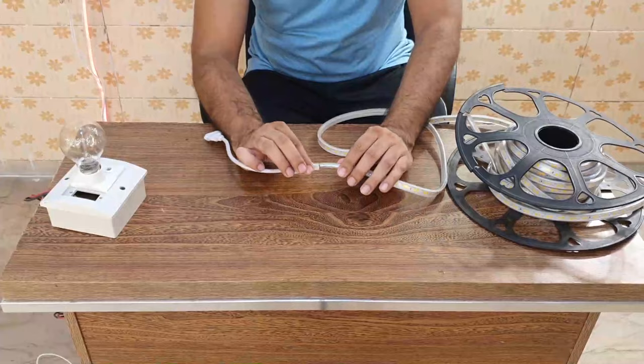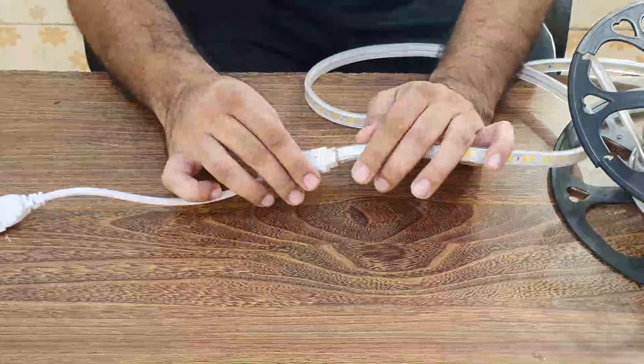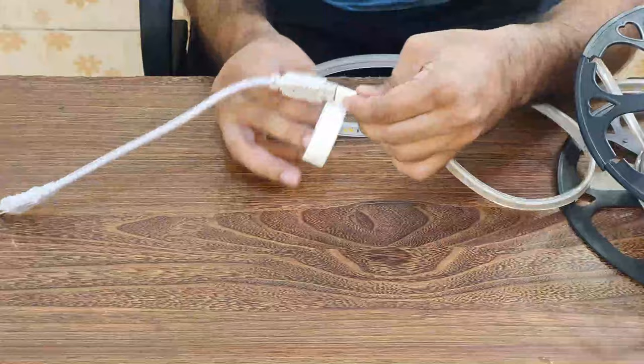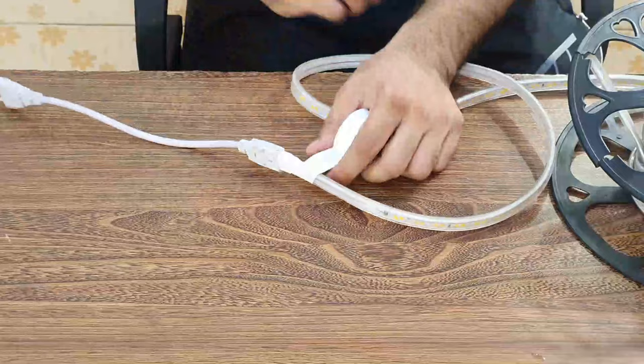After doing this, the most important thing is the taping. When you put it on the connector, you have to do the taping, because this is a very sensitive thing. Sometimes it will spark and you won't know what the problem is on the ceiling. When you have to put it on power, it will be really difficult. The reason for taping is to save your rope light. You tape it on the top for insulation — this will be a very good finish and very useful.